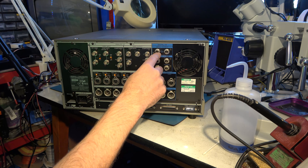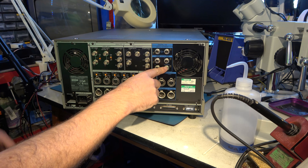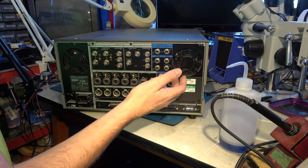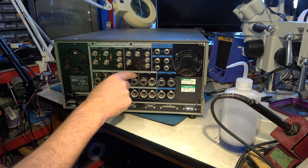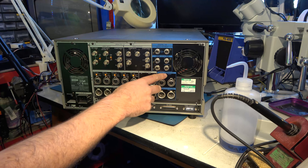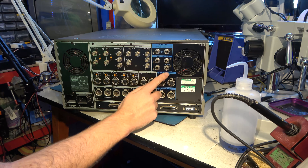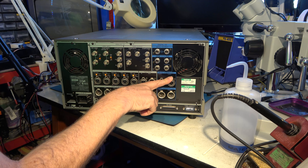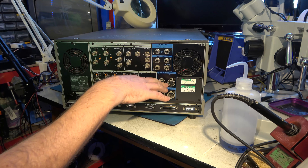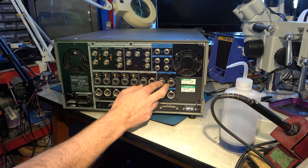This is the SDI signal — there's input and outputs. You've got one with superimposed readout information, so you wouldn't want that anywhere near the broadcast system, because you don't ever want that seen by the end user. Then there's digital output here, which is AES/EBU. That's essentially the same format as you'd get from a normal CD player — AES/EBU is very closely related to the normal digital audio connector, or indeed an electrical equivalent of the Toslink connector you see on a CD player or MiniDisc.